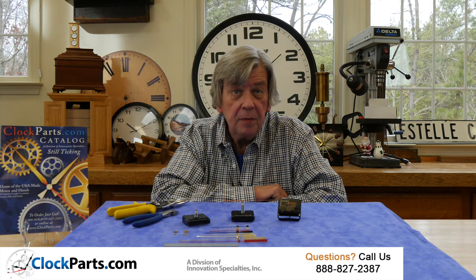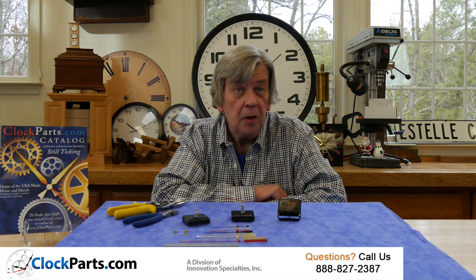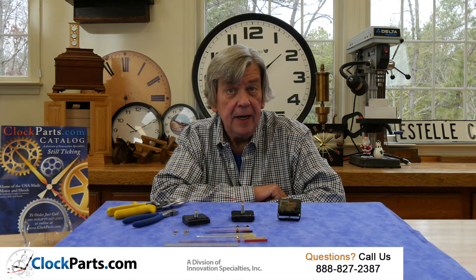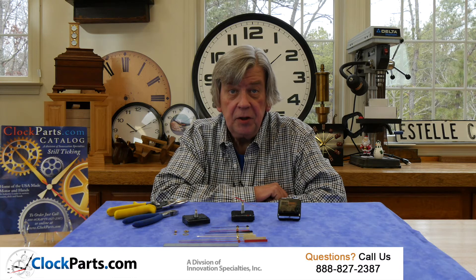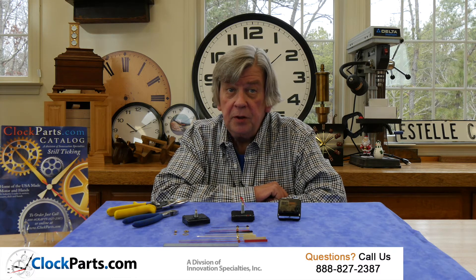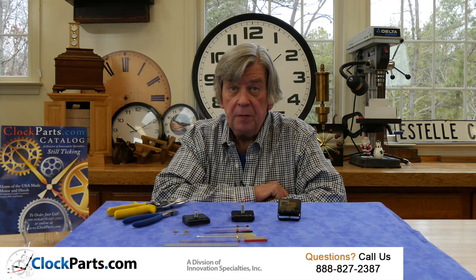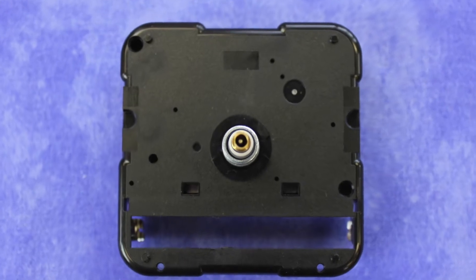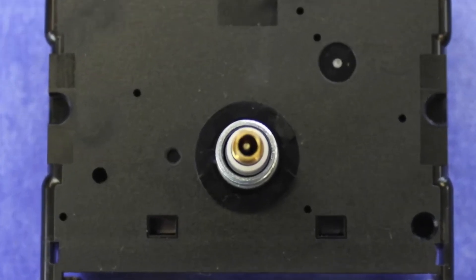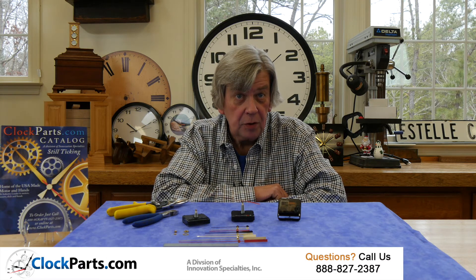The hole in the bushing is 0.034 to 0.035 inches, which is larger than the bushing on most of our second hands. They will be too loose on all of the other eye shaft movements we offer, because those movements use a smaller 0.030 to 0.031 inch mounting hole. The bushing size difference of 0.004 inches you can't see with the naked eye, but you sure can notice it if you're putting the wrong second hand on a quartz movement.